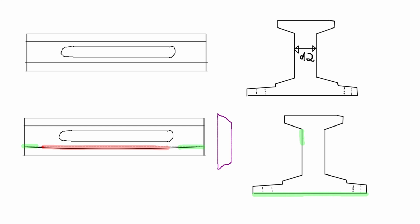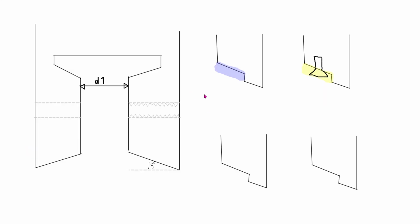We can go back to the dynamic jaw. First thing we need to do is make sure these two surfaces here are parallel to each other, because the original design used the bolt coming from here. The bolt would screw in here and pull both sides together to compensate for slop, and this would deform the vise permanently. So after a while, these two surfaces aren't parallel, but they look like that, and you need to fix that before you do anything here. So how can you do that?